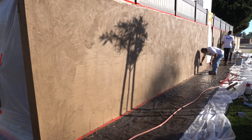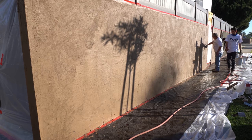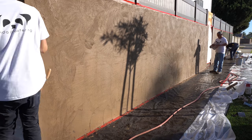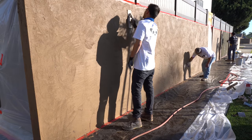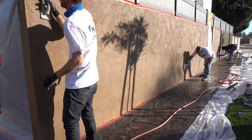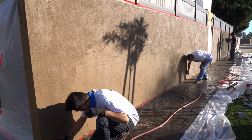Miguel is working ahead applying the corner tool on all the corners of the walls. Smooth finish is one of the finer finishes — compared to a sand finish, where you just apply it, float it, and keep going, smooth finish is one of the more expensive finishes because you have to apply two coats and work the material until it's nice and smooth.